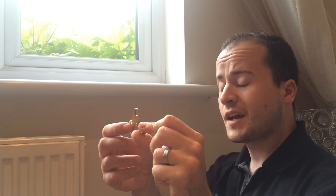Now you need two things: you need a bleed key — this one lives on my key ring — they come in a few different shapes and colours, some companies put their logos on them, but so long as you've got a square bit at the bottom and some kind of lever to turn it you should be fine. This one was about 50p from Wilco, so they're not expensive. You also need some tissue paper.